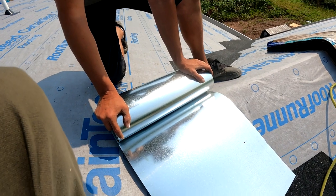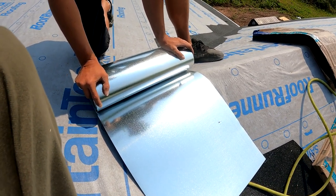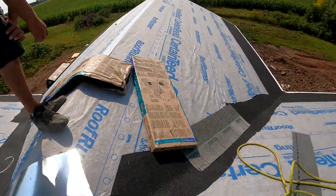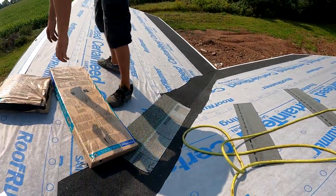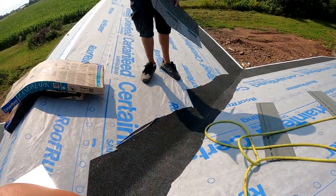What is up everybody, it is Life's Apprentice. Today we're going to be teaching you guys how to install valley metal on an asphalt shingle roof. This valley metal is what we use for a closed valley. There are other types of valleys installed slightly differently for an open valley, and in a case like this you really don't need to put in valley metal, but it is recommended. It's going to prevent possible leaks in some scenarios and it's going to make the valley a lot more sturdy if you have gaps or cracks in the plywood.